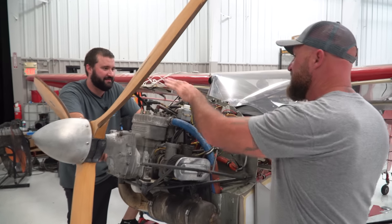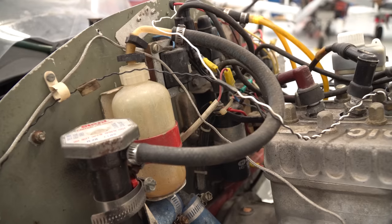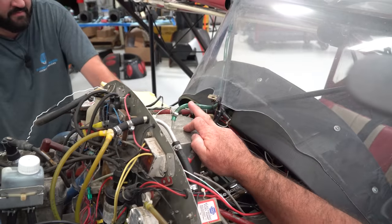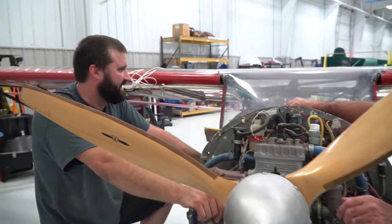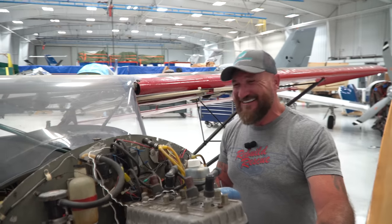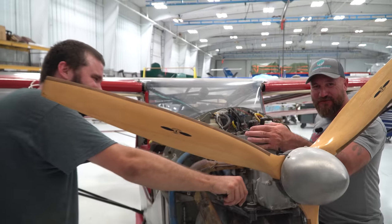The secondary spark coil is just there for show — it's not firing. We also have a fuel line at the quick-disconnect going to the left-hand fuel tank that we'll need to sort out. Pretty much all the rubber hoses up here are just old. There's a fuel line that's see-through, which makes it easy to see fuel, but personally I'd like to know what kind of fuel line it is — it kind of looks like Tygon, like lawnmower fuel line. Experimental baby — basically this is HD Aerospace meets your local snowmobile power-sports store. And this is the 50th one, so it literally kind of is.